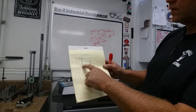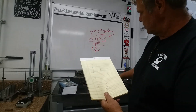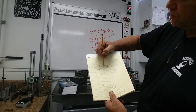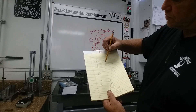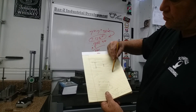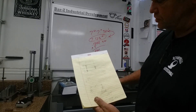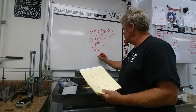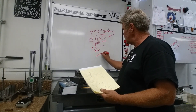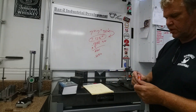My original calculation — this is the paper I actually had the other day — all I did was take the centerline, basically cut the whole taper in half, which was 0.125, and just multiply it by five, which is absolutely the wrong thing to do. I came up with 0.6250. So there's a 5-thousandths error in my gauge block stack.